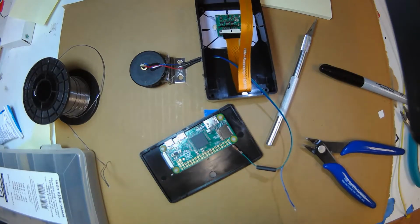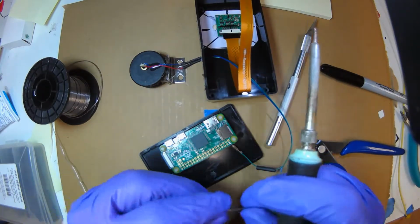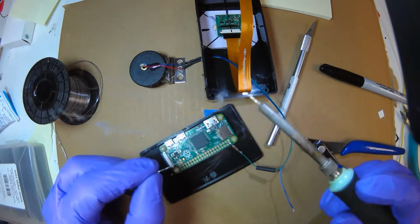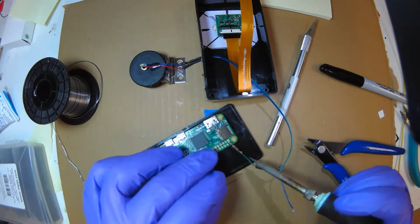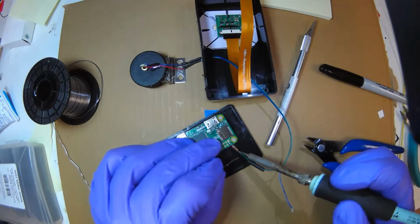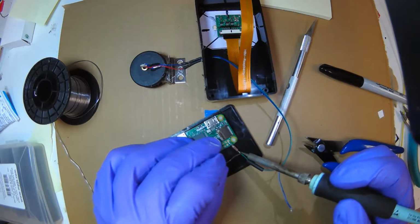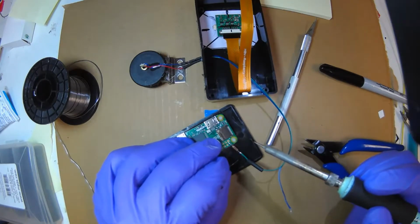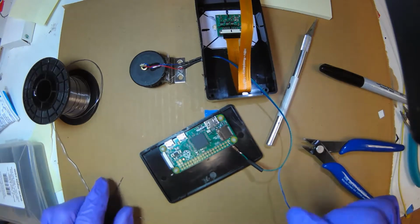The art of soldering, again, clean tip. I clean my tip. I put a little solder ball. So I have molten lead, which is thermally conductive. Oops, so I'm going to put it on this joint here. Let the heat conduct for a little while. Then feed solder into the joint. Not on the iron, but the joint. The joint should be hot enough that it melts, and it does. Let go, let it cool down. And you really want it to cool down.